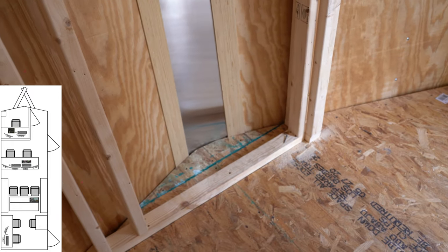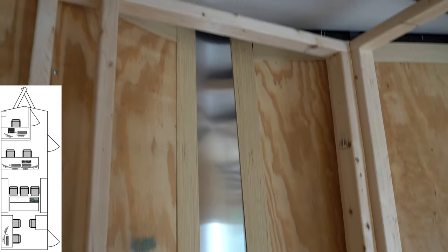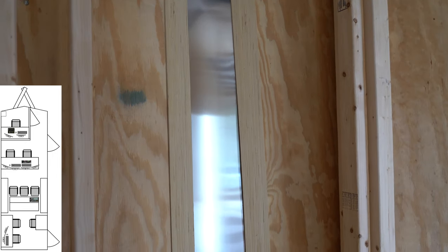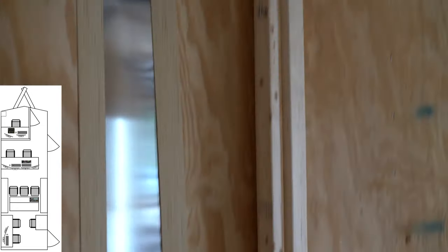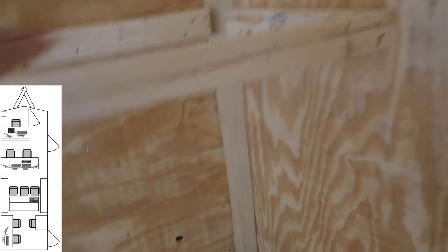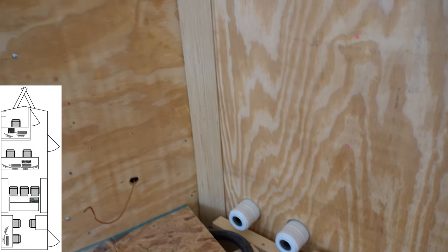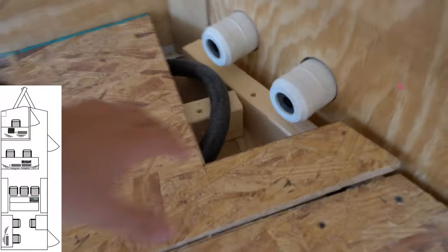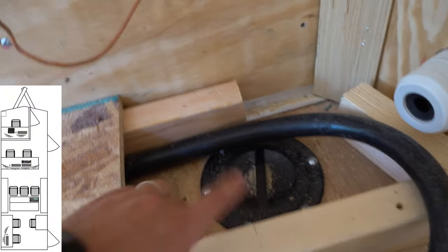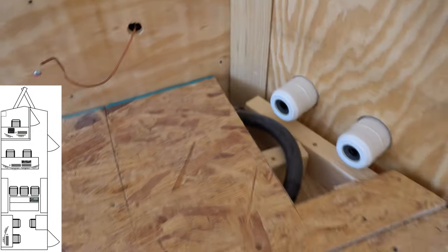We framed this little area out here, which we might put a little bifold door and make maybe like a little cable closet out of here. You know, they can hang some patch cords or XLRs or headsets, or some sort of storage, maybe shelves or something. But we wanted to box that out to kind of square this room up a little bit. Over here, in order to hide the power, what we decided we're going to do is probably just put an additional leg here to come down another stud, and then we'll put a little plywood here just to cover this up and you'll never see it. But it still remains good to have that access port to come in here, and I can use this to bring any cables in that I might have from the exterior on this side of the trailer.